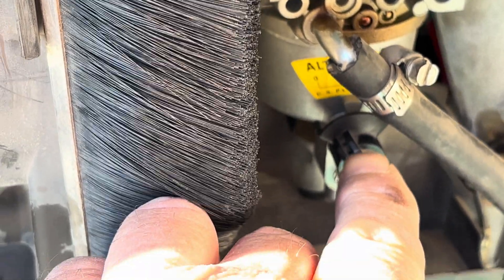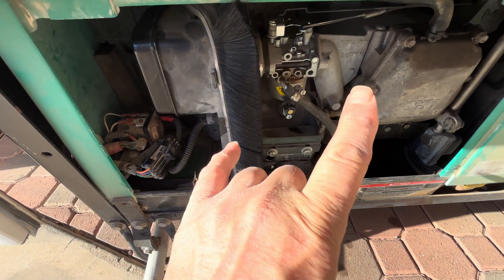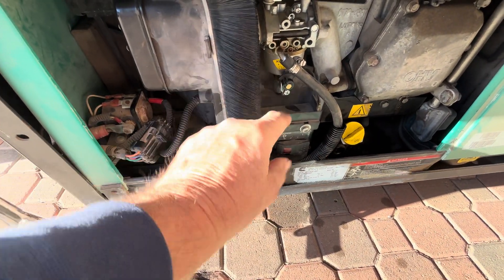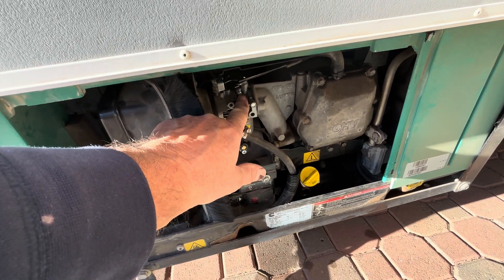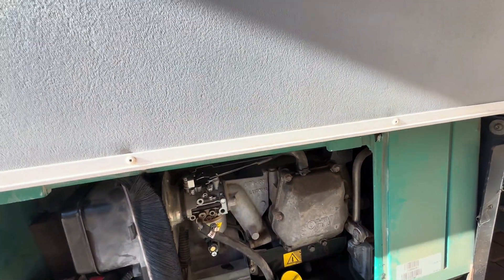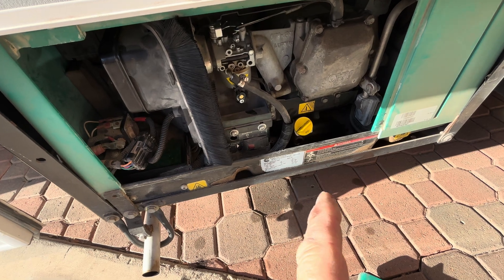There is a notch right here — I'm below sea level, so this is set at sea level. On the other side, the adjustment is for 10,000 feet. I would turn this knob clockwise; it's at around the 10 o'clock position now, and at 10,000 feet it would be at the 2 o'clock position. This adjustment can cause it not to run. There's another adjustment right up here, and some adjustments in the back that I don't really suggest messing with. I went counterclockwise on one because the spring was compressed all the way — I let it out a little and it seemed to run better.